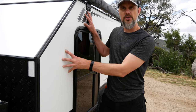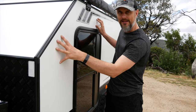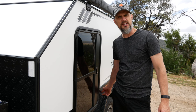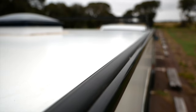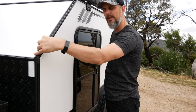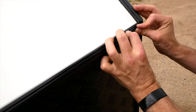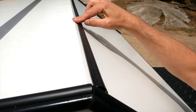For the final exterior finish I used Colorbond steel sheets at 0.7mm thickness for the top part, and for the bottom part I used black checkered aluminium at approximately 1.2mm thickness. For all the joints I used J-mold trims, and similarly for the flat joints I used flat J-mold trims — these are fantastic because you can use screws to securely fasten them in place and then place a rubber decorative strip which covers all the screws and protects from water. The top sheet of the Colorbond is folded and sits above the next layer.